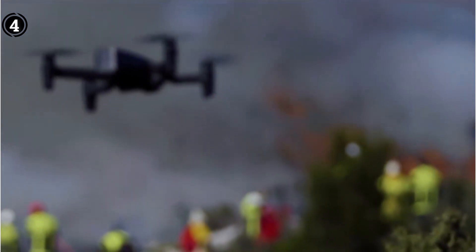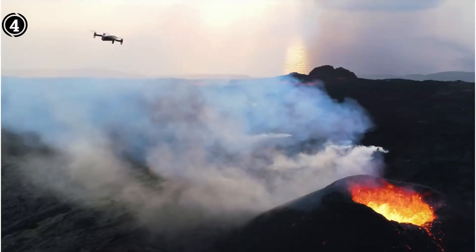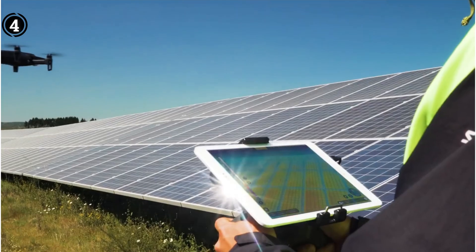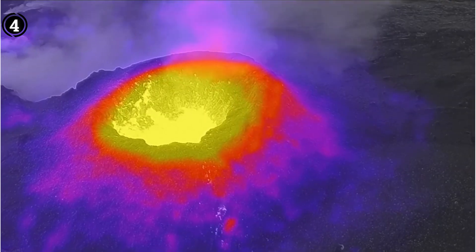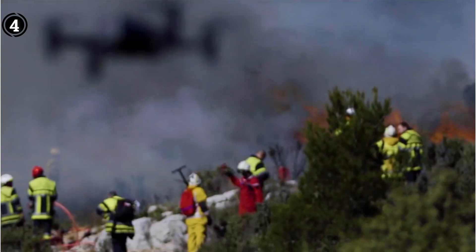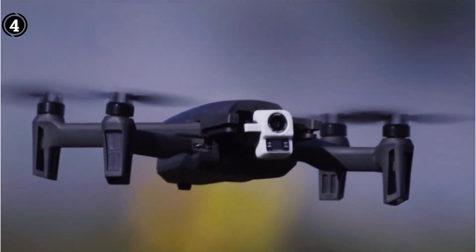But this roofing drone's remarkable dual-camera capabilities aren't its only noteworthy feature. Its ultra-compact and lightweight design make it portable and built for optimum field utility. The drone can fly for up to 26 minutes at a time and weighs less than a pound, which should be more than adequate for the majority of drone thermal roof inspection tasks. Additionally, you may use it in difficult circumstances because it can withstand winds of up to 31 miles per hour. Its 2.5 km Wi-Fi video transmission range makes it possible to check big structures all at once without any problems.